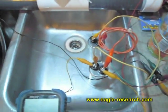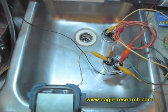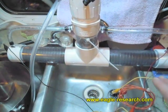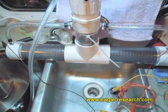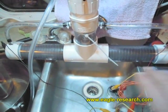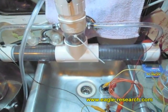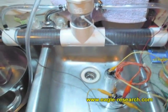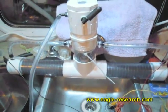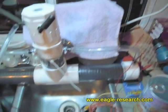Doubling the capacitance generally would double the amperage of a capacitive power supply, but in this case, the electrolyzer itself has a resistance as well. So the more amperage you push through it, the higher voltage the electrolyzer takes, and the less the capacitors have to work to keep the amperage down. There's a certain amount of amperage that the electrolyzer will keep it at in any case — I'll show you that in a minute.